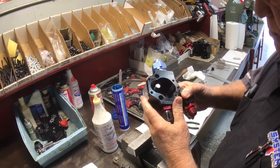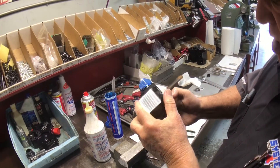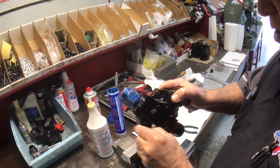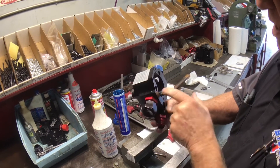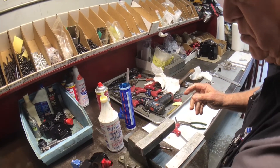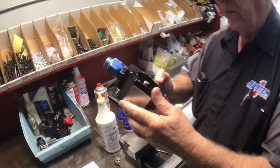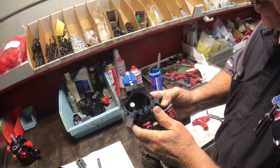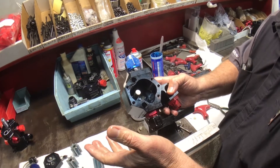What can teams do to make sure their pump stays in optimal condition? They just have to make sure that if they run trash through them, they clean them up, because running trash through it hurts them. This pump just has some signs of wear from use — it's in very good shape. Essentially, if you have some sort of problem and get metal through the motor, don't just clean out the oil pan. Make sure you take your oil pump apart. You can see how easy it comes apart — it's made to be very simple so it can be serviced very easily.